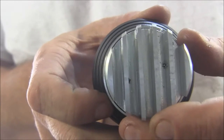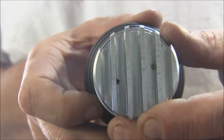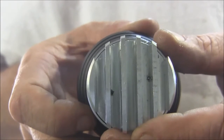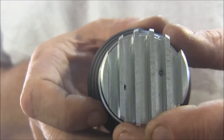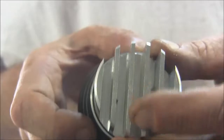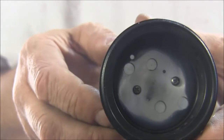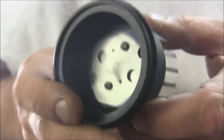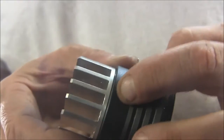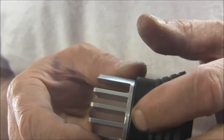You gotta be careful when you're drilling all the way through because you'll hit the fins, and if you're not really careful the drill will catch because it's going to be on the side. So just be careful that you don't break the drill off. And now I'm gonna mark out a hole somewhere here and drill in and tap it